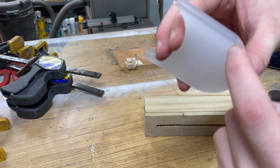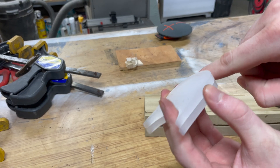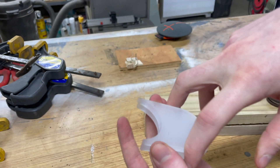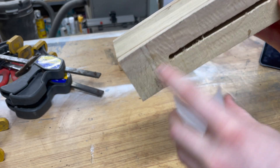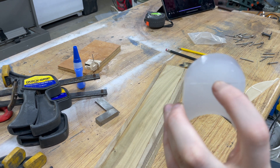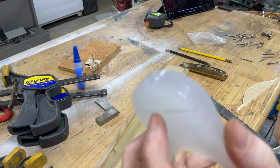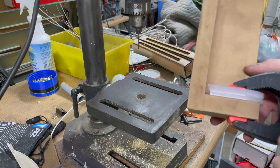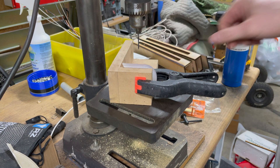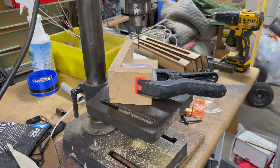What I have to do to this still is cut a notch or groove down here, which is going to be where the trigger mechanism locks into it. I'm going to carve a groove down the back so the string can set into it and won't jump out. I'm also going to put a metal rod coming out both sides that'll help me cock it back and will also stick out here to keep it from flying out with the cookie — that way this will push the cookie out but won't go out itself. I scratched a line with an X-Acto knife and I'm going to go in with my rotary tool and carve out the groove. I need to drill a hole down the side of this and I don't want to just plunge in with the drill bit, so I have devised a new method.